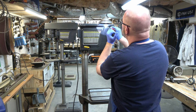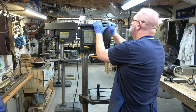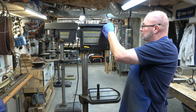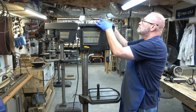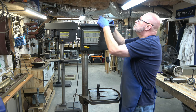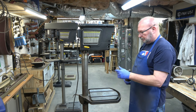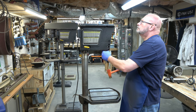Unlike the 100s and the 150s, there is only one machine screw in Gen 3 and Gen 4 commercial drill presses, and it's only on this side. Whereas on a 100 or a 150 there are machine screws on both sides. This machine screw rests on top of the bottom bearing for the spindle pulley assembly bearings, so you have to remove it to get that entire assembly out. Sometimes you can just lift the assembly straight out, but on this one the bottom bearing got hung up in the bore. You can use a wooden dowel — place it on the bottom of the assembly, not on the bearing, and then just tap it out. You'll see the bearing start to rise up out of there.